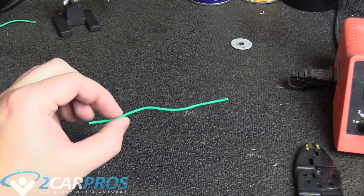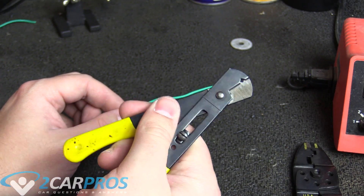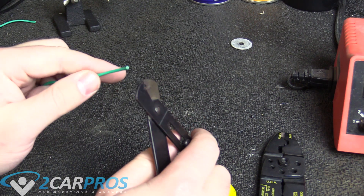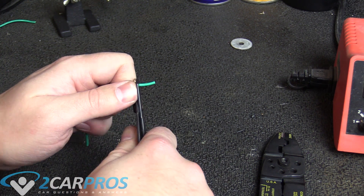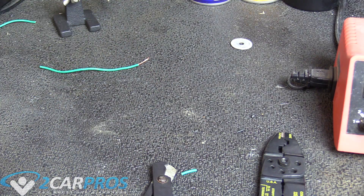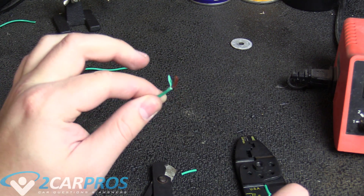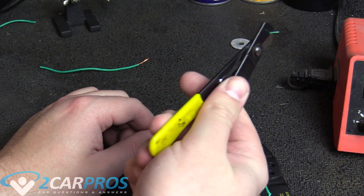What I've learned when it comes to soldering wiring is learning how to strip the wire of its insulator. There are basically two types of wire strippers: this type that is adjustable with how you feel it, and this type that already has it ready to go. I personally like the adjustable ones because you can really feel when the wire bites through. You want about a quarter of an inch to half an inch of space to work. You want to bite down until you feel it give way and then just pull the insulator off. With the fixed type, you just find the matching hole, clamp down, and pull it off — but I can never fully rely on them to do 100% of the job.